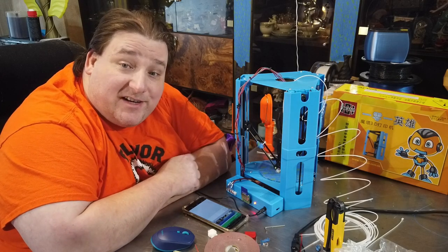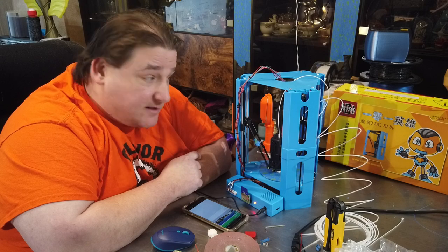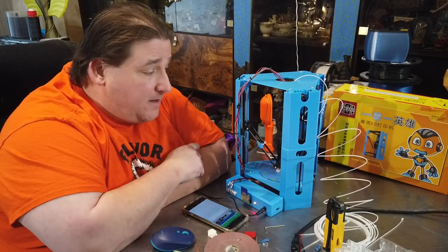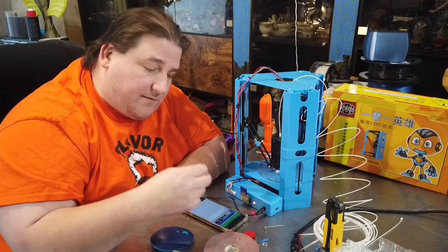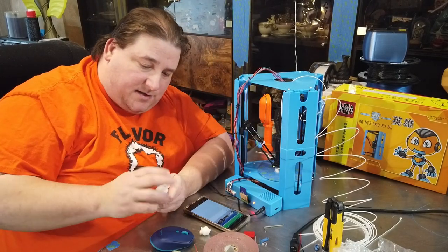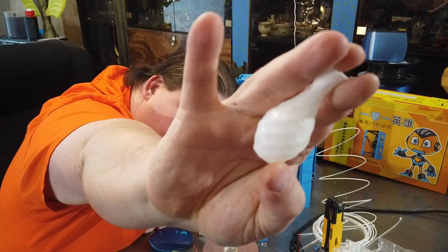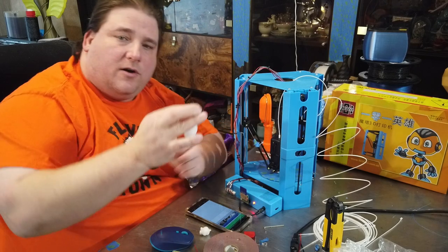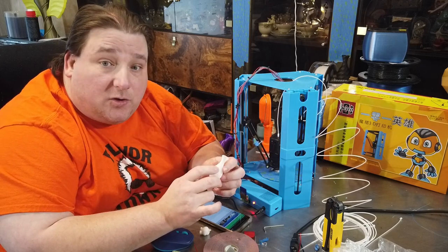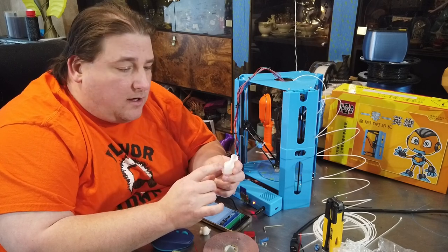Well Critters, 101 Hero — as you can hear it's damn near silent, and I was really surprised by that. It turns out the slop that was causing bad prints is also the slop that was causing noise. I put a zip tie around the three sets of effector arms, pinned it on one arm so it wouldn't slide down but left it loose on the other arm, and that tightened them up and got rid of almost all the slop. The artifacts I'm seeing I think are related to going too slow — heat buildup causing extrusion issues. So I've increased speed to 15 millimeters per second and turned off the per-layer minimum speed requirement so even small layers won't slow down further.